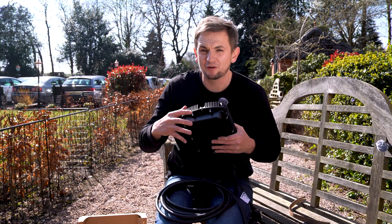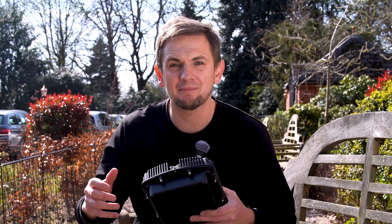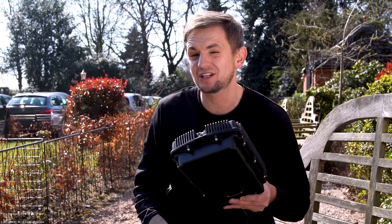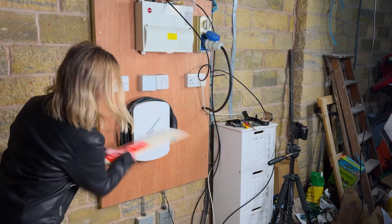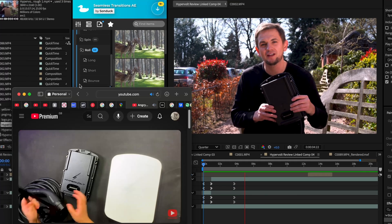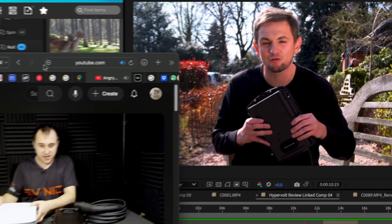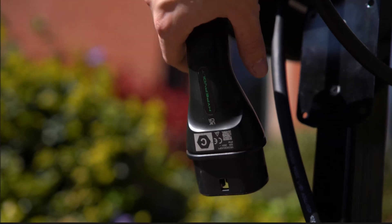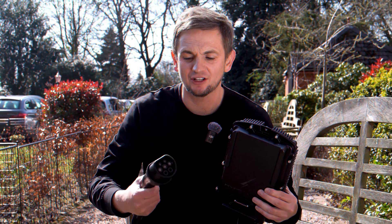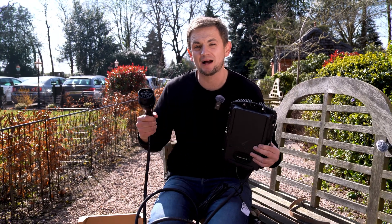On top of the weather rating, it's also impact resistant — it's got an IK10 impact resistance rating. You can basically hit this with a cricket bat and it's going to be okay. In fact, someone did do that. There is a YouTube channel called EV Nick — well worth checking him out — where he put one of these to the test by whacking it with a cricket bat and it stood the test. Impact ratings are really important because when you've got the charging lead and the connector, that's a pretty heavy bit of kit — if you whack your charger you do not want to split it and have to buy another one.